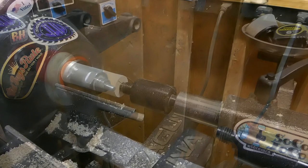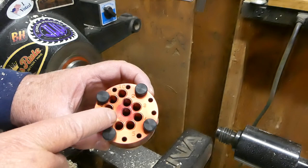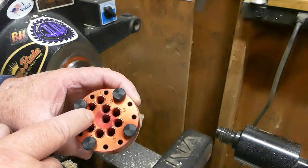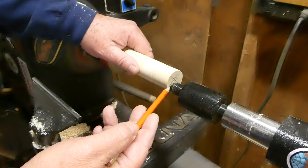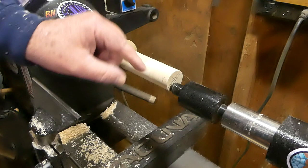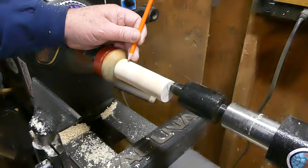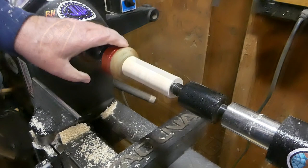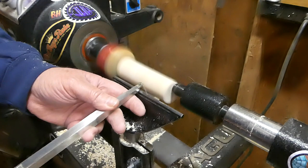These positions are marked — I was at the center hole and I think I'm going to go to number two, just because I don't know what I'm doing yet. I went to two on the bottle stopper and it came out okay; I might have to go to three, but I'll start with two. I don't have very much meat right there to play with, so I'm going to leave a waist end or a tag in here. I don't want to go too far back because those threads tapped in there are probably a half inch to five-eighths of an inch. We're going to use the Easy Wood Tools number one hollower at just over 1200 RPMs with light cuts.